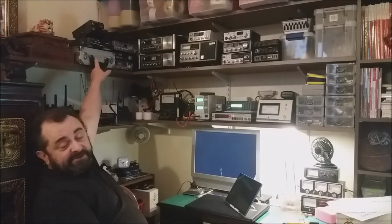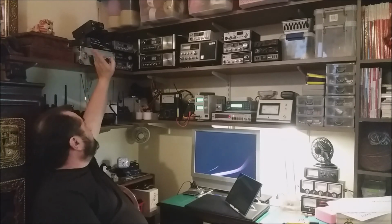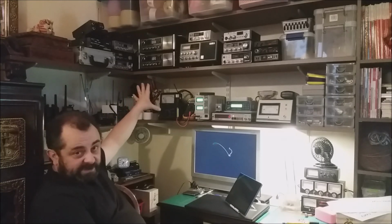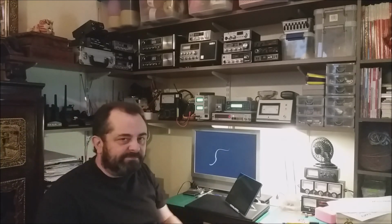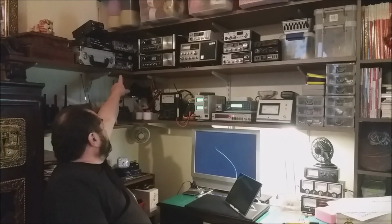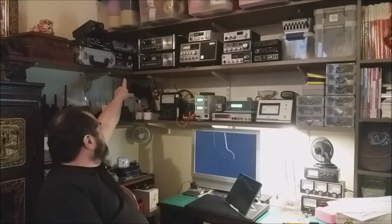So there we go, folks. That's pretty much it for another episode. And yeah, what can I say? Very enjoyable time spent on the nets this week, and a successful first proper outing for the Craftsman 2. You may have noticed it was only lighting up 3 lights on transmit. That's because I was running it off the tracer battery, which puts out 12 point something volts, not the full 13.8. So that's why it was like that. Unveiled now is the Mustang up there, so that will get a chance on a net sometime in the future.